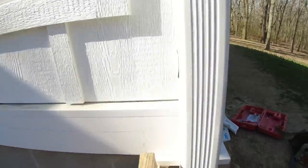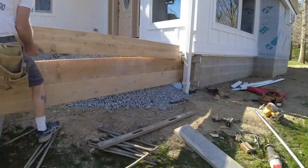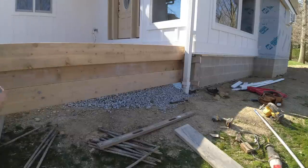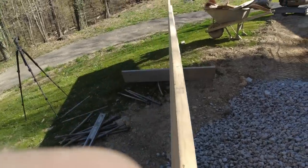I want to leave the camera running — I'm just a little bit tight, I'll take a sliver off right here and I think it's going to slide right in there, notch right around that. Okay, took a little sliver off of that nub. Let's see if it stays. I'm going to cut a little bit off right here just to close this quarter-inch gap up and we are good. Let's get this screwed together — my ledge and step liner is going to set right here and give me a little cantilever look.